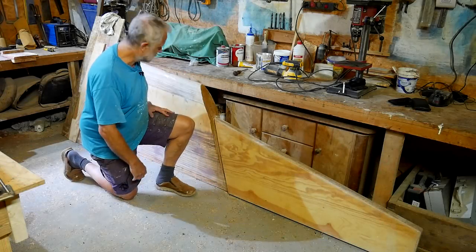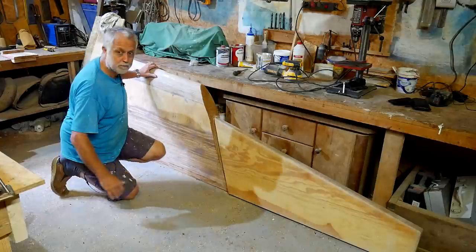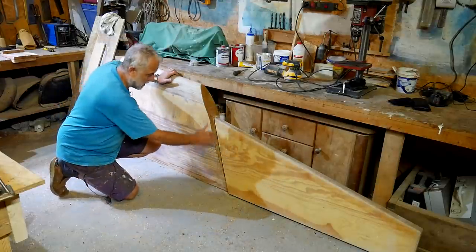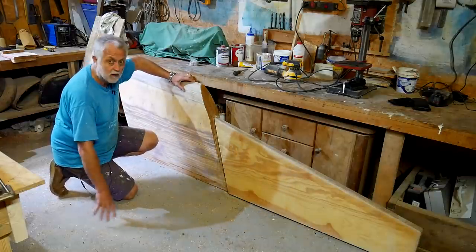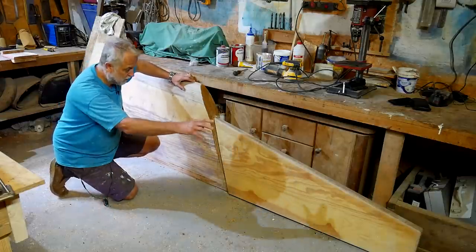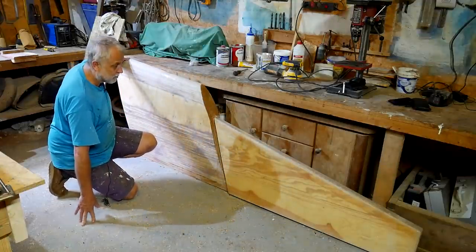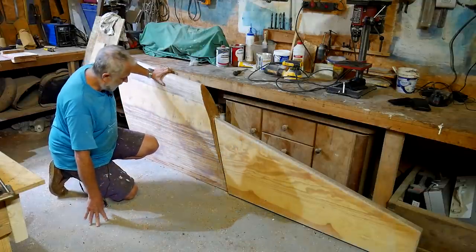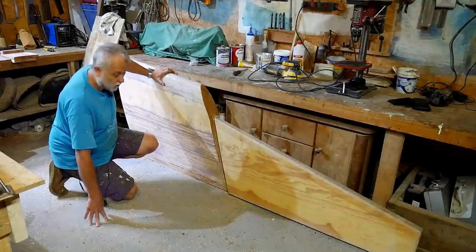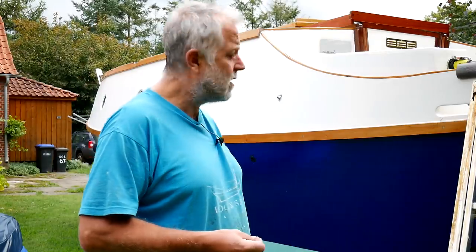And here, as I said, is the rudder as it stands at the moment. To all intents and purposes, it's built. It will have end plates top and bottom, hardware missing, obviously, tiller, steering. So all pretty simple, hardware for the tiller, hardware for the pintles to hang the thing. And a bottom bearing support where it sits on the keel, supported by the back end of the keel. Airfoil shape and airfoil profile, which is a nice big rudder that should be very effective. Having said that, let's have a look at what's been going on this week.